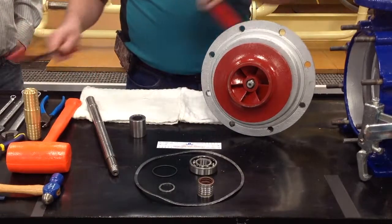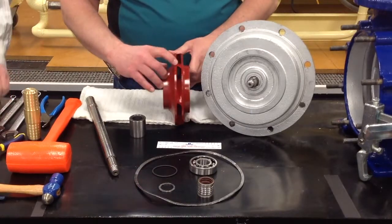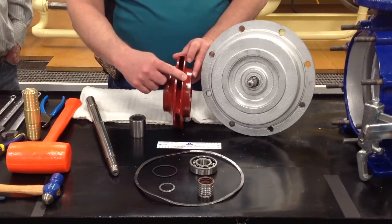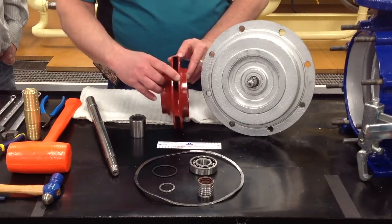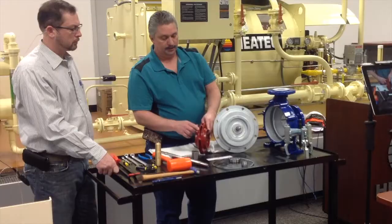As you pry the impeller off, you'll see on the side of the impeller that you have a vane with the vane walls. All your pulley system or your pry bars, when you go to pry this off, need to be on this wall. Do not pry it onto the center because you can break or crack this impeller.